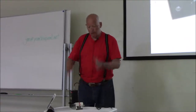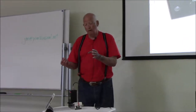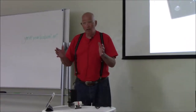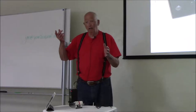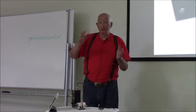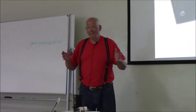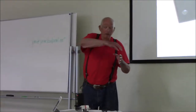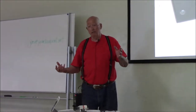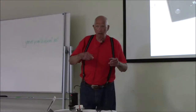It's two plates of metal, and I pump electrons with an electron pump from one side to the other. I deplete one side of electrons, I put a lot of electrons on the other side, and the voltage between those two plates gets real high. An interesting thing about a capacitor nobody thinks about is I cannot deposit more charge in a capacitor than there are free electrons in the metal, because that's where they come from. Electrons are coming off this plate and going onto that plate, almost like charging a battery when it's not a battery. And in the case of an inductor, what is an inductor?